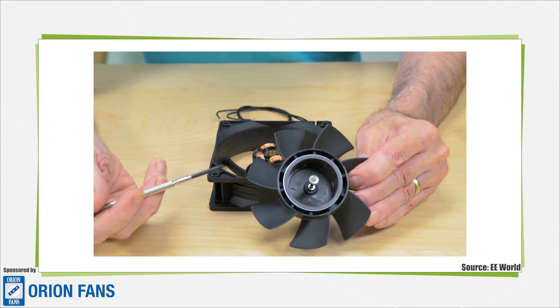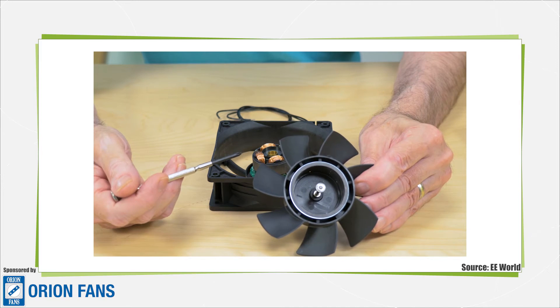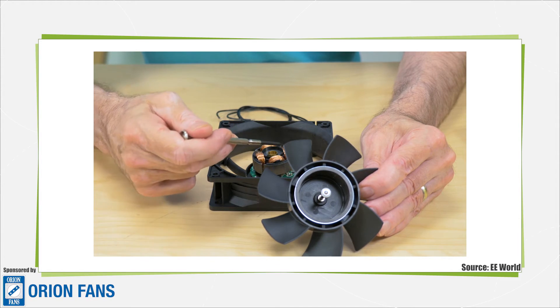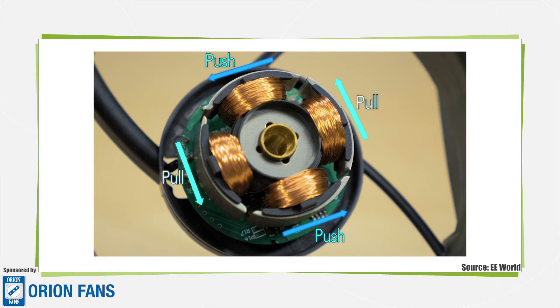Let's show one sequence as an example. To start out, one set of coils — say these two — would be energized to become electromagnets. Then the opposite poles of the rotor and stator are attracted to each other. As the rotor nears the energized coil, the next coil is energized. As the rotor nears that one, we're back to the first set of coils, and they're energized with the opposite polarity. So basically you always have one set of coils pulling on the rotor.